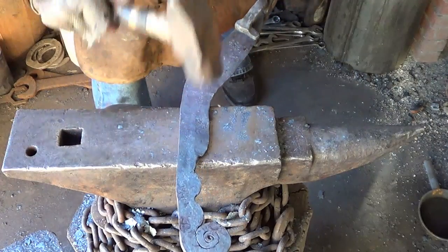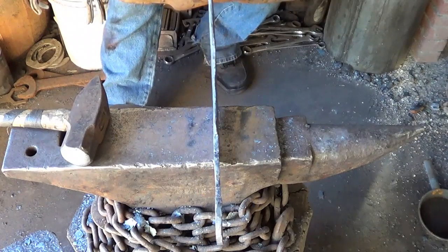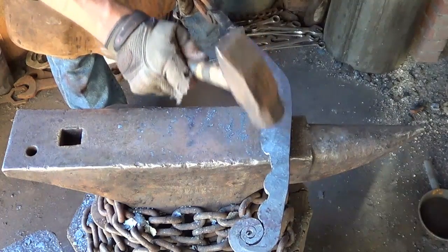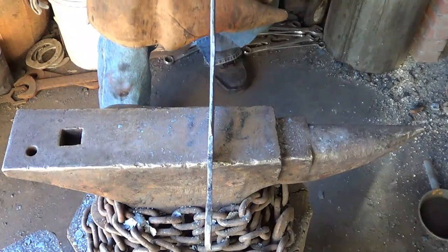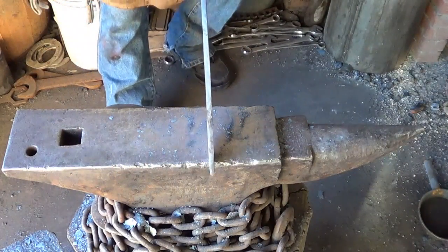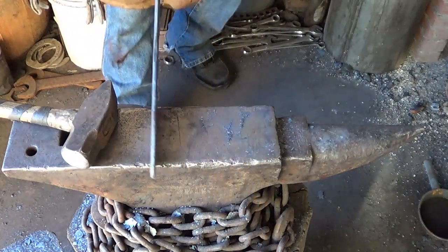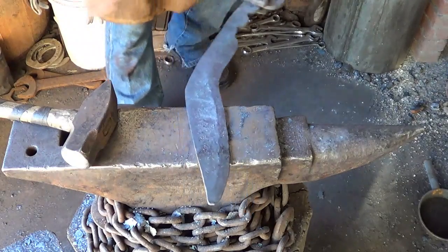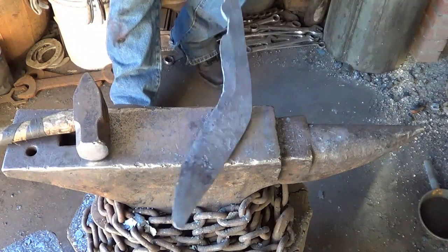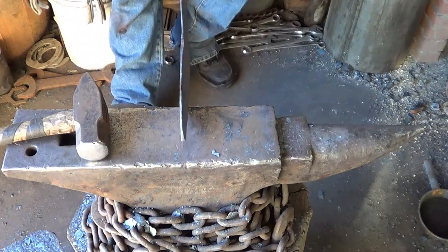Same thing, when you get done hardening your blade, all that work, rough grinding, all that part done, you're looking at it, it's like, damn, alrighty, let's put a handle on it, and you realize you forgot to drill it. There's tricks that might help you do that, but put it back in the fire. Put it back in the fire, because you're just going to fight yourself.